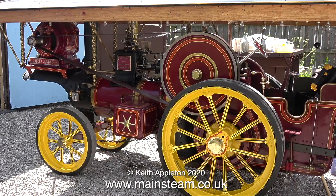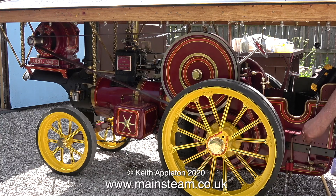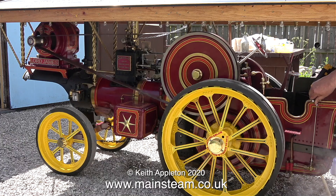This is a clip from when I first got the engine — the first steaming outside the workshop — and as you can see it's not injecting properly. My first thought was to change the injector for a new one. One of the first jobs I did was to fix the linkage to the water tap, which as you can see was all over the place. The water valve at this time was just an ordinary old gas tap and maybe it was leaking. Either way the injector would not work.